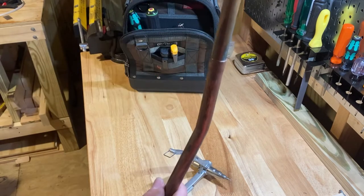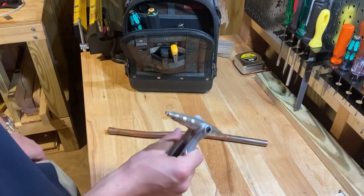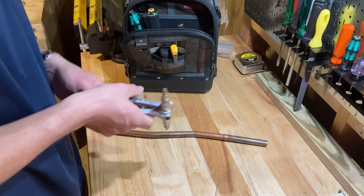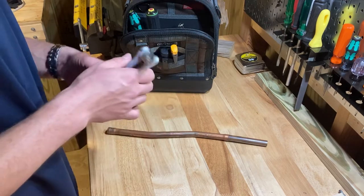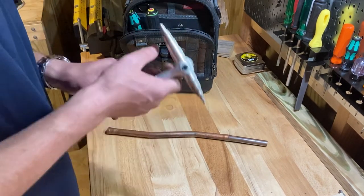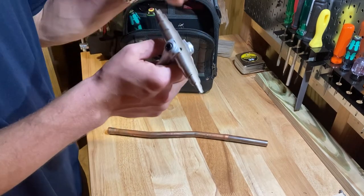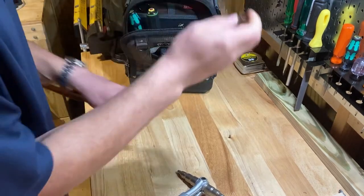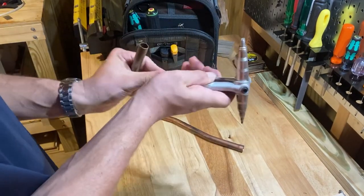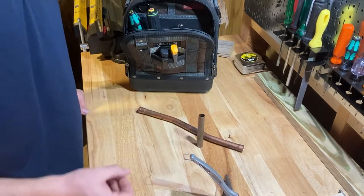With a coupling you'd have a top piece and a bottom part, and that bottom part is hard to braze. This has just made doing so many jobs easier. If you're a guy who has to replace a lot of evaporator coils or compressors, you could use something like this. And if you've ever gotten into a pickle where copper pipe gets crushed or pinched and it's not round anymore, you can just take this thing and make it round again. It's gotten me out of so many pickles for just $17 — just unbelievable value.